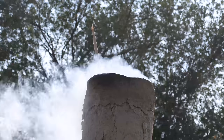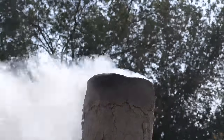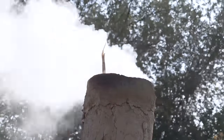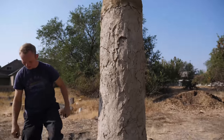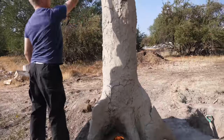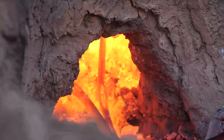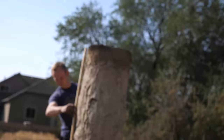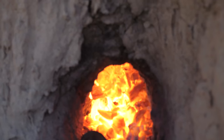They're hoping the taller furnace will increase the amount of time the iron ore is exposed to carbon monoxide so it can turn from iron ore into elemental iron. They've smelted over ten-plus times in total, and using this furnace probably five or six. When first built, it was only about four feet tall and a little narrower. They wanted a natural draft furnace with slightly larger capacity, so they kept building it up over time. It's lasted through winters and is remarkably durable — they think it could run through another dozen smelts easily. One of the tough things about smelting is what a finicky business it is. There can be multiple good ways to do it, and even slight variations on what works would not have worked.